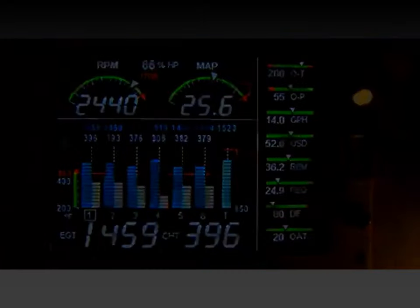All right, so this is basically everything you need to know about those buttons. I prefer to use the little three position switch that you just saw. That's on the bottom of the panel. There's now a little switch that says EGT, all, or fuel flow. Depending on what you're interested in, you flip it either to EGT or to fuel flow or to all. And whenever you flip the switch, it restarts the automatic indexing of those parameters.